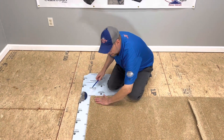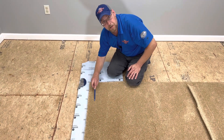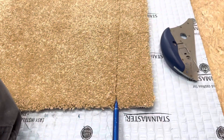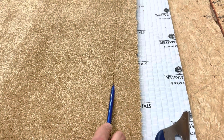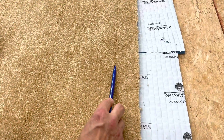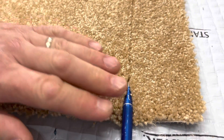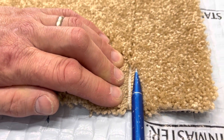I know which way the pile is laying down, so I'm just going to stick the row finder right in there and push forward. It will actually follow the rows all by itself if you just push it right in there. We're going to take our row finder and just push it right through the fibers — it's actually following a row in the carpet backing. It'll go the complete length of the carpet if you just keep it going. And now if you look, you can actually see there are no carpet fibers at all right there.